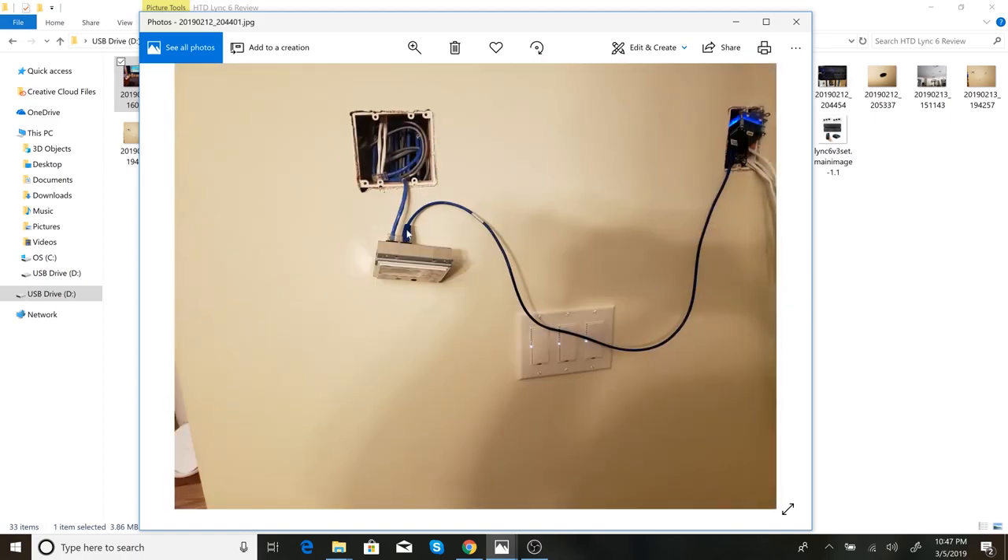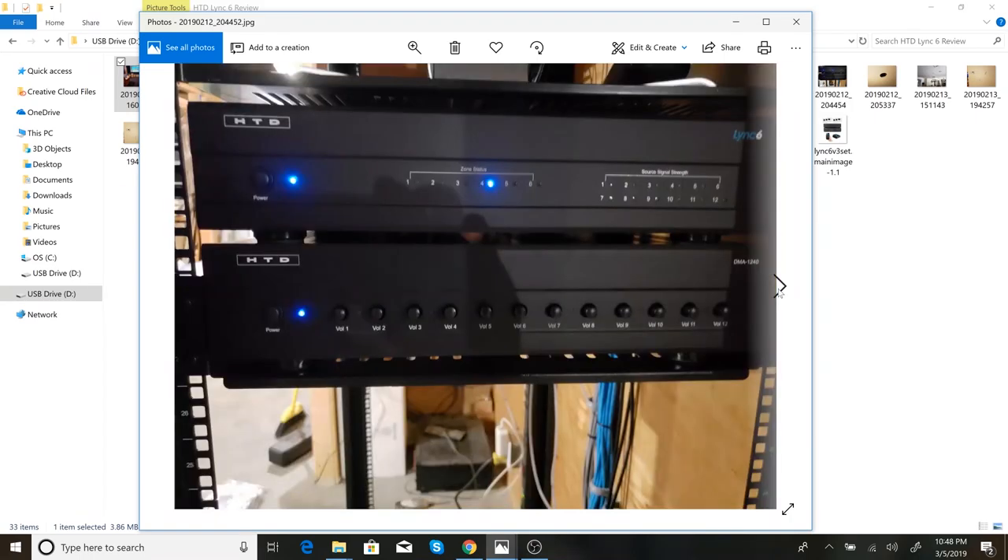Back to the keypads — the wire I was able to just terminate with RJ45 plugs. Those Leviton modules use the A wiring pattern, so I just put the plugs on with the A pattern and fed them into the back of the keypads. This is just a standard patch cable going between the keypad, and this is the Bluetooth input panel that I jammed into the volume-control box just for testing — so that was all temporary.